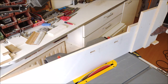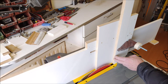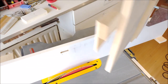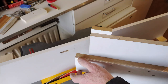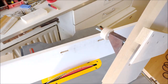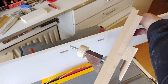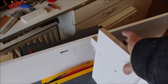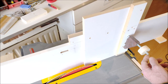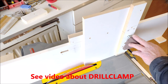That's maybe a time-saving thing — this one fills it up and there is your workpiece to cut. The jig is built up with a little support plate in the back with an extra piece just as thick as your fence. The clamp is simple — it's just a threaded rod, 3/8 of an inch, with a finger knob and a triangular piece of wood. There's also a video about that so you can see it in detail.